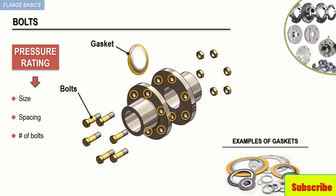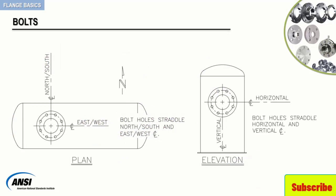In this regard, the American National Standard Institute requires all flanges straddle the horizontal, vertical, or north-south center lines of pipe and equipment, as shown in the following two figures. The left figure depicts a plan view of a horizontal vessel, and highlights in exquisite detail the bolt hole arrangement, spacing, and number for the nozzle flange. The right figure depicts an elevation view of a vertical vessel, and shows the bolt hole characteristics for the nozzle flange.